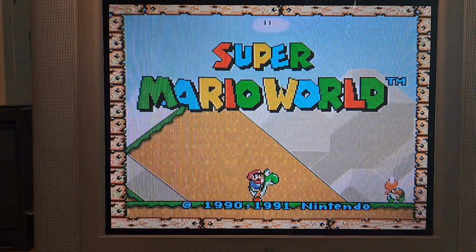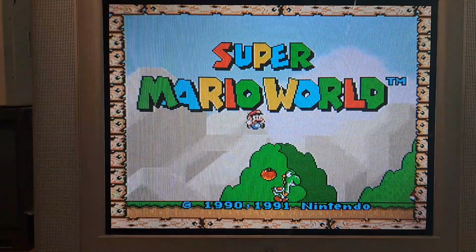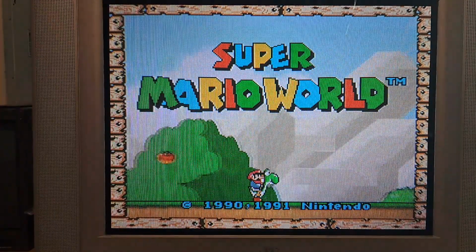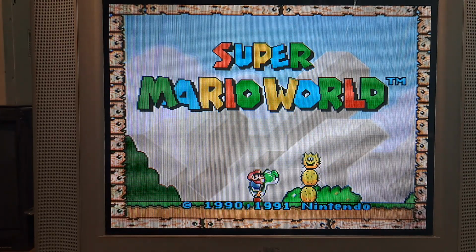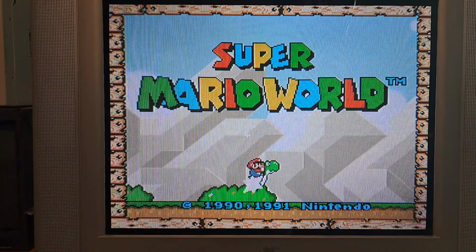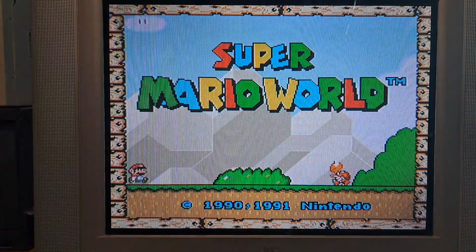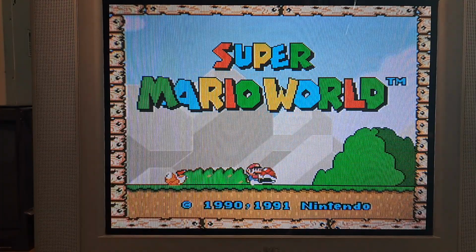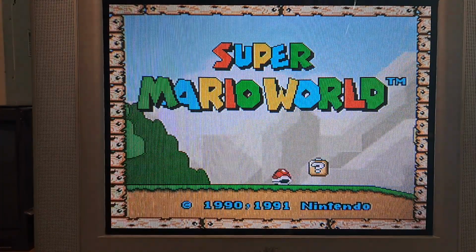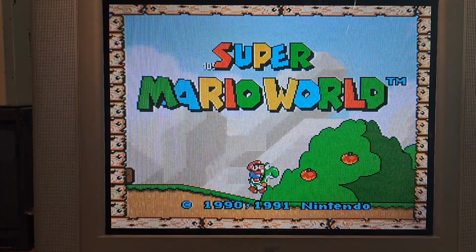I decided to do so just because I kind of know what I'm doing whenever it comes to purity itself, and kind of what are the things that are going to happen if you do adjust the rings. Because, like I said, it does adjust the position of the geometry for the screen, as well as it does mess with the convergence. And at times, too, it can actually mess with the bowing of the screen, especially on these flat CRTs, so you're going to want to be careful of that.